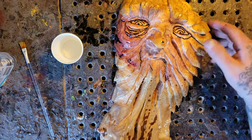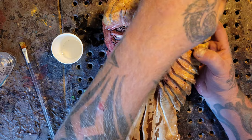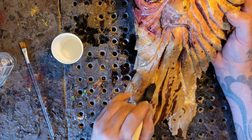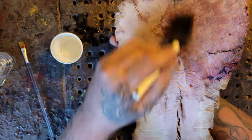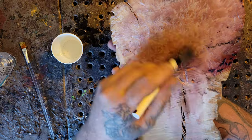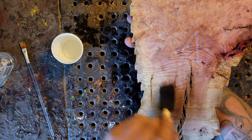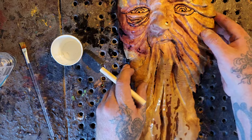Okay, so this one is going to go darker when the oil sets in more. I don't know if it's as the oil dries, but I know it sinks more into the wood, and that's when it gets darker. But really, there's nothing special about this piece. This is the back, the part that had the wicked bird's eye on it. Yeah, I signed it. So just goes to show you, when you get the bird's eye or nice burl wood or wood with special grain, you really need to sand it to get the grain to pop out. So, anyways, let's move on to the next one.